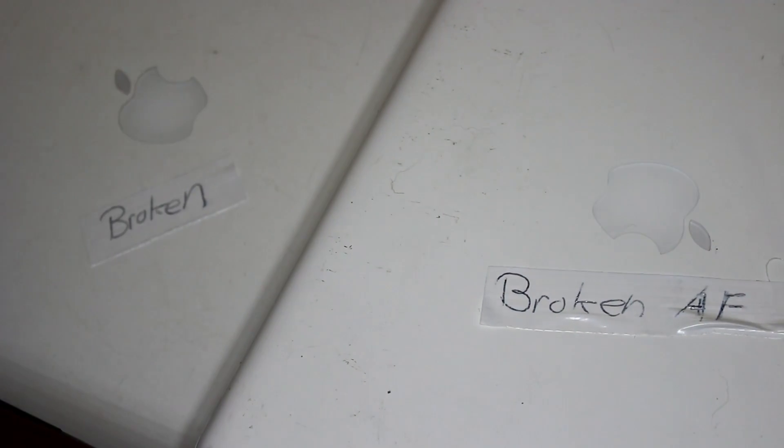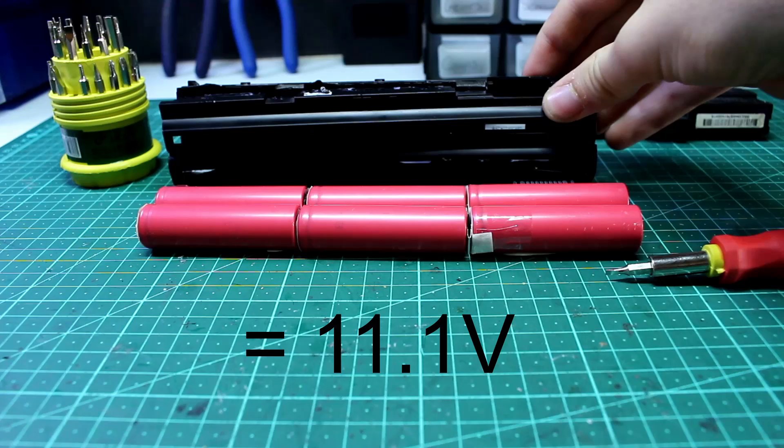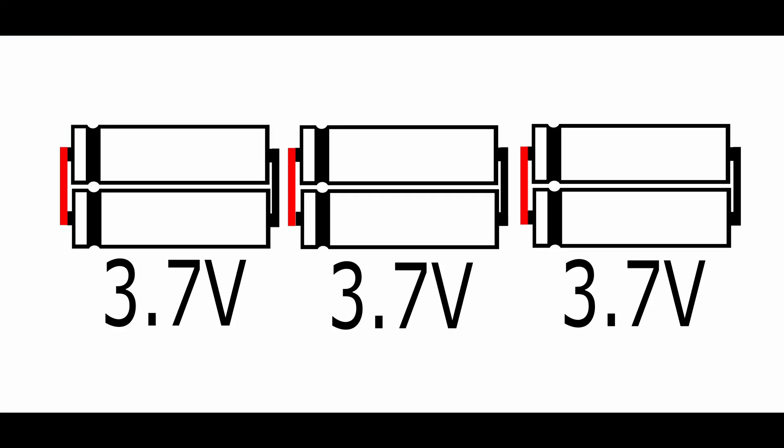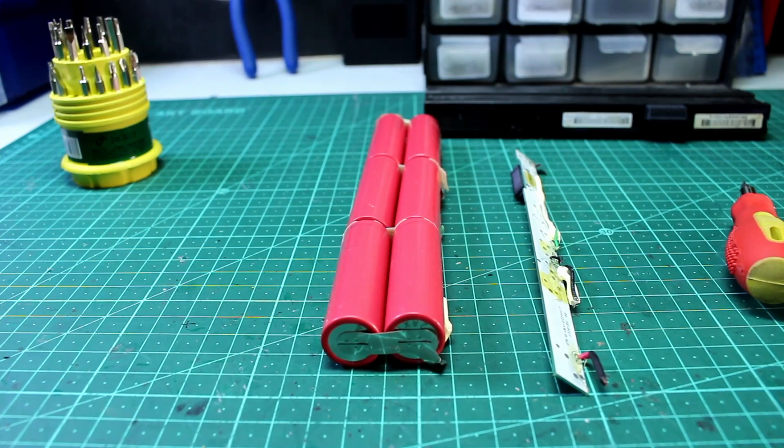When I'm looking for lithium batteries, I always look for old laptops, as these have the highest quality battery brands and the most cells within them. Most laptops typically operate at about 12 volts, and since lithium cells operate at about 3.7 volts, three cells in series add up to 11.1 volts. Laptops usually use six cells divided into three parallel pairs, each pair connected in series, which produces 11.1 volts — so you'll typically find six batteries in a laptop.